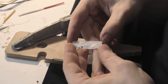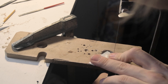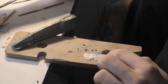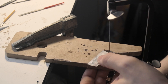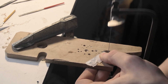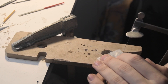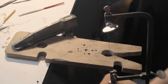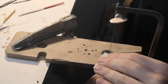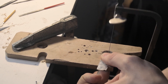Now that we have all of our pieces marked out, we're going to start cutting these out with a coping saw — or jeweler's saw, depending on which term you prefer. The main principle is not to exert too much pressure on your saw. You don't need to move your saw around and twist it every which way; instead, move the piece around and just keep everything nice and level. We're not quite cutting all the way to the line — leaving a little bit of space for adjustment.